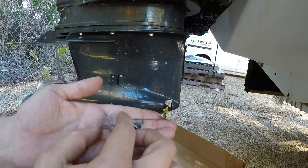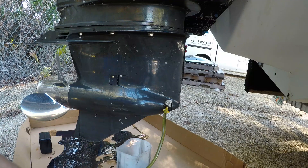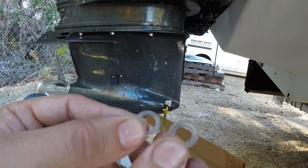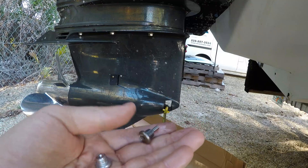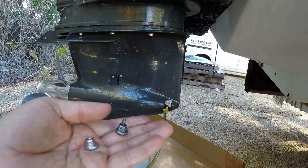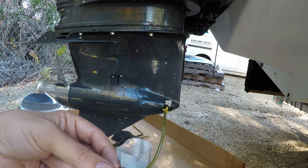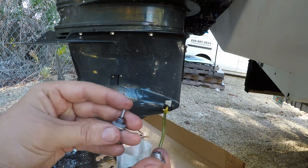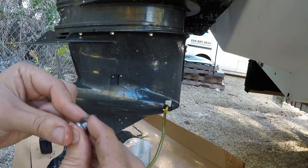It's recommended to use a new drain screw and washer. Here's the new nylon washer; here's the old one — they're designed to smash down after you tighten them. The only thing I'm going to do is not use the new drain screw, because the one that came out of the motor has got the little magnetic tip on it. I actually like that because then you can check to see if you've collected any metal shavings. I'm going to put the new washer on the old drain screw. Now that you've watched the video, you know the Evinrude G2 300 is going to have the little magnetic tip on it, so you can order the new one and maybe just save that for a rainy day.